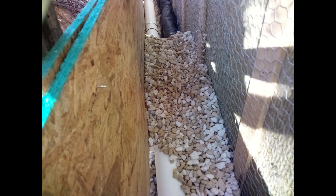You may have noticed the formwork around the perimeter of the cottage. For drainage, I'm planning to install a layer of gravel directly against the wall. To maintain the separation of the gravel and the fill dirt while backfilling, I made these forms with OSB and lumber bracing. I'll touch more on that in Part 3. Thanks for watching.